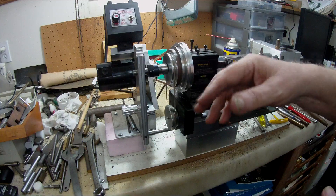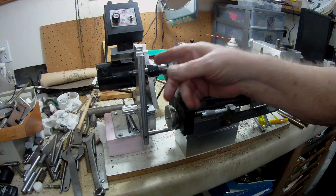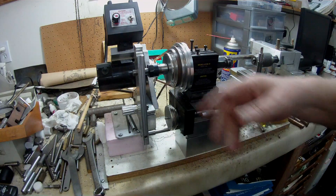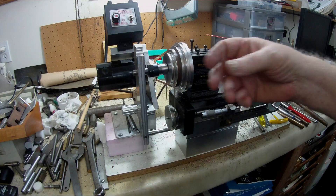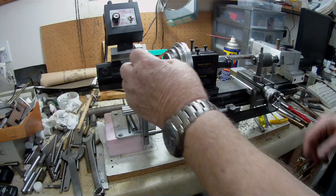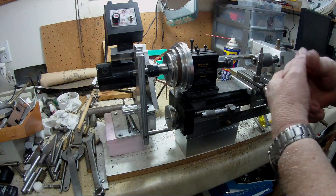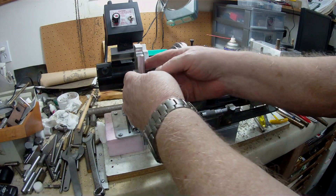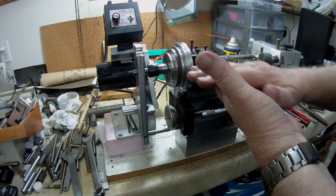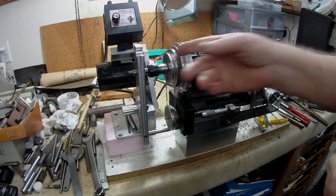My next operation is to put this plate on the mill, dial it in, and bore it through with a boring bar to open it up to 5/8". Then I can make up five or six half inch round plugs with pitch threads machined in by standard taps. I just need to place them in there with some kind of locking screw — I might even put a wedge or a key in there. That's going to be my next operation.